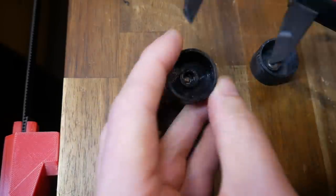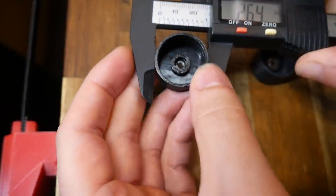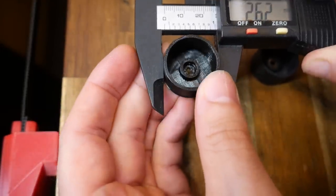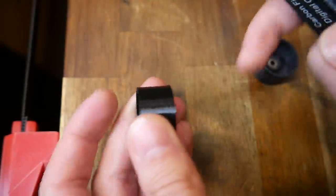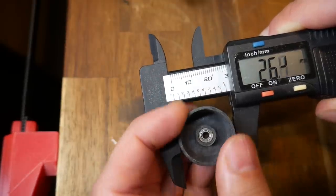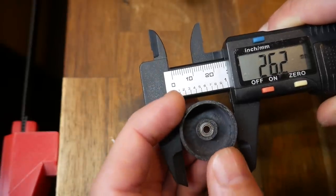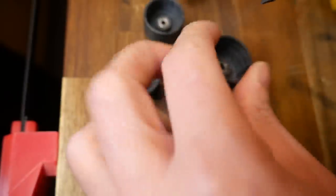Next up, external diameter. The rules stipulate a minimum of 26mm, so we normally aim for around 26.2 or 26.3. The completely printed version is pretty accurate for this, but there is variation, meaning it's not entirely round. It also has a slight bit of elephant's foot, so in that section the diameter is actually closer to 27mm. The printed-then-machined wheels were quite consistent, measuring 26.2mm consistently around their diameter, and best of all the diameter was quite repeatable across the set of four wheels. The CNC I used has ball screws instead of belts, which probably helps with consistency.